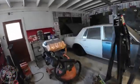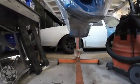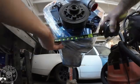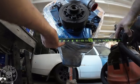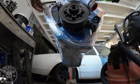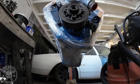That's small block. This big block Ford — I think it's actually quite similar to small block Chevy as far as width. I've got this one in plastic. Yeah, it's almost exactly the same, around 15 inches. Overall width: we don't want to build it so narrow that it'll fall over. Two feet — this thing's about exactly two feet with no valve covers on it, so the majority of the weight is within two feet width. That should work out.